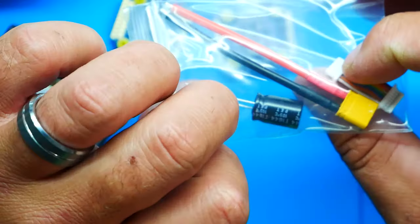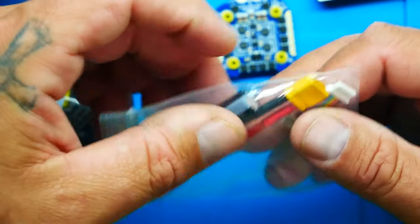You also get a capacitor — a low ESR electrolytic capacitor, 470µF 35 volt. Why 35 volt on a micro? Because this guy runs all the way from 3S to 6S LiPos. It is a 35 amp ESC, so feel free to run it on your big quad. You're welcome to run XT30 or swap it out for an XT60.